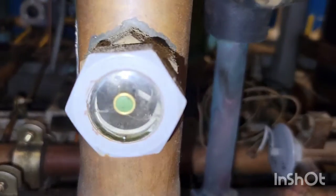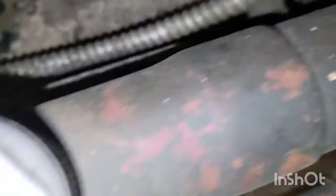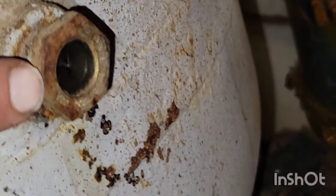I hope that clears it up. We're going to go over multiple examples of sight glasses and what constitutes a flashing sight glass. So flashing sight glass, example number one. You can also look down in here - it's hard to see, but you can see that looks like a raging river. And that one looks like bubbling. And then you can come over here to your receiver - this tank, in this case, it's a surge tank. And you look and that last ball is not floating there. There's a little ball at the bottom. This is another example - very similar to the last one, but you can see it's just kind of bubbling just a little bit out of the top. That's a leak, and that's low refrigerant.